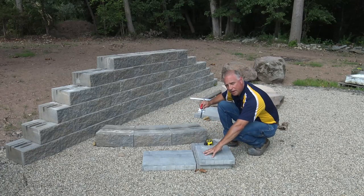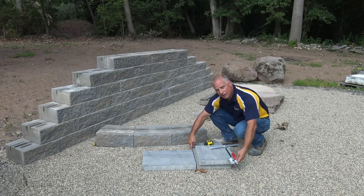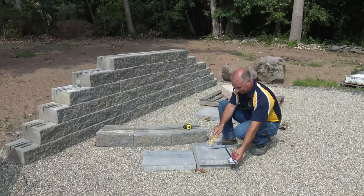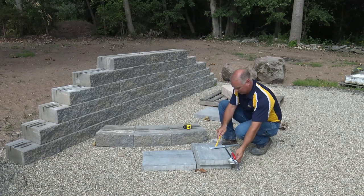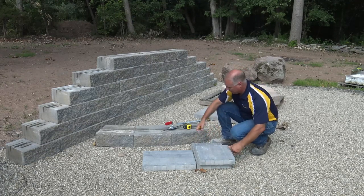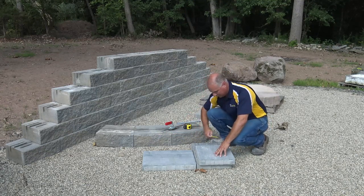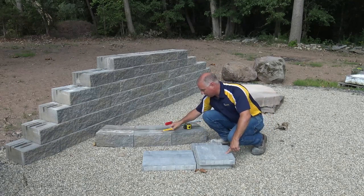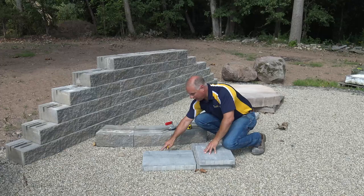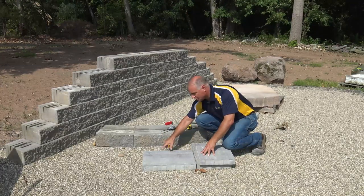Now what I'm going to do — if I'm going to put this paver in this hole — I hold this now. This corner right here, I'm going to hold this right on the very corner so that I can mark it. You can see this angle — it's the exact angle of this right here. I want to mark this angle because this isn't just one straight cut, it's another angle. And if it's a radius, you can do the same thing in a few different places. I've marked this point right here, and with it being a random pattern, it just depends on where that paver is going to end. I've already marked where that ends.